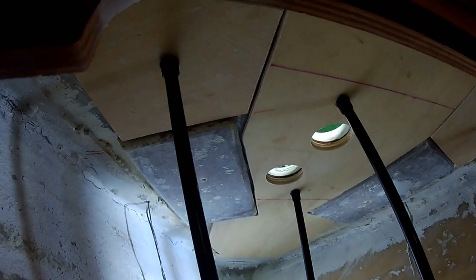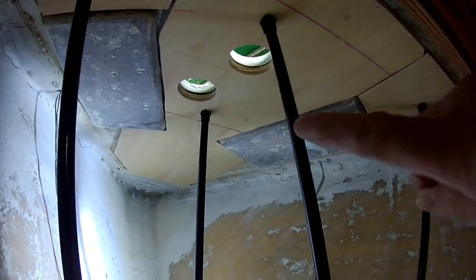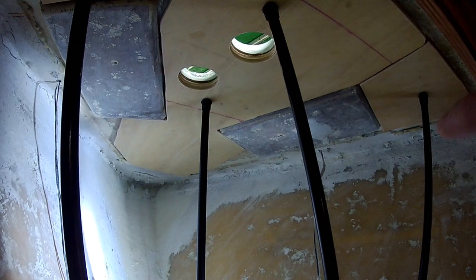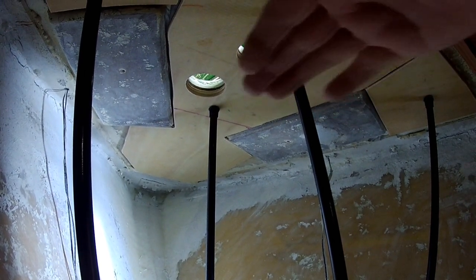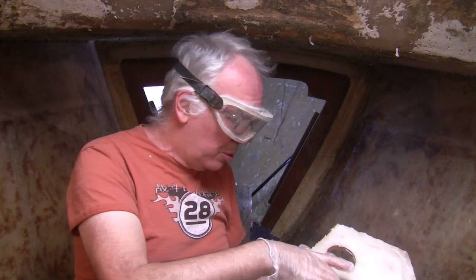So what do we have here with these sticks? What can they possibly be holding up? Well, for better or worse, these are the bits of wood that I'm putting in, and you can see I've done two side bits. There's a bit of a bevel on this one, and you can see, I think, a line there. That's where the front of the G10 is on the top. I'm actually going to cut that so that's into two, but it means I've got an absolutely flat surface here where the actual winch is. This is slathered with thickened epoxy.